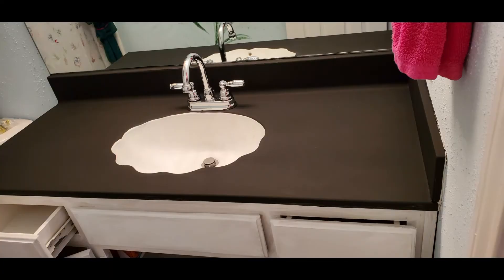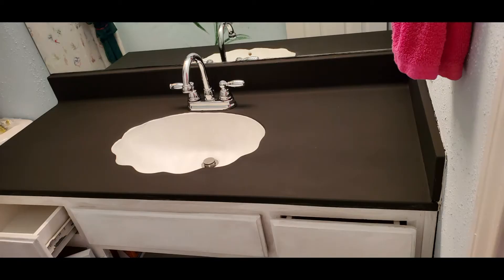I got busy and painted the cabinet white and put two coats of black chalk paint on the countertop. Then I painted the sink basin. After one coat it was kind of streaky looking, and I thought that looks kind of cool. I consulted my daughter about it and she liked the streaks, so I left it streaky. After it dried for 24 hours, I began applying coats of polycrylic to both the sink and the countertop — four coats, just like I did on the bowl.